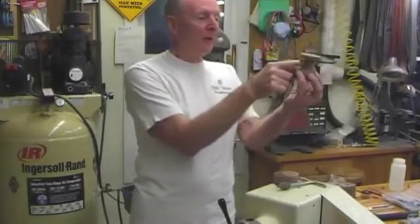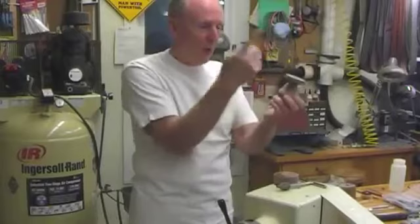Crab apple is interesting. You've got the lighter sapwood on the outside and the dark, sort of reddish brown on the inside. It's similar to walnut, although when you look at the end of the log, the pattern of the heartwood to the sapwood in crab apple is very erratic, whereas in most woods it's rather straightforward. This is a partially done piece, the bottom here, the top, and this will later be shaped and formed into a little sweep out.